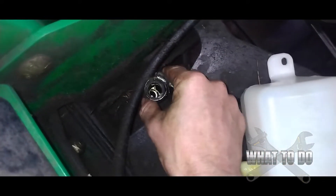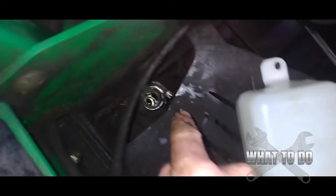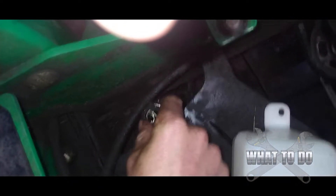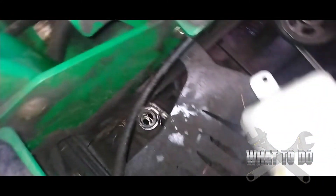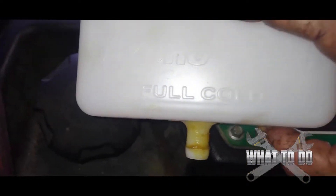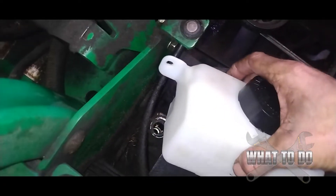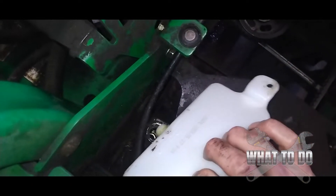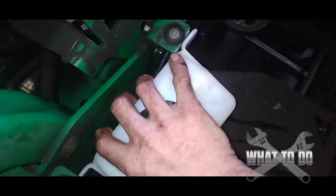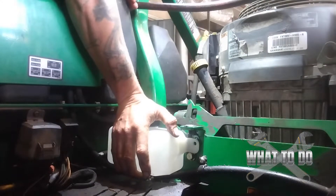Now we have our new reservoir. One thing I was worried about was that this hose was going to be really flimsy and hard to push back on, but at least Bobcat did something right here — this hose is actually really tight. You will be able to put some pressure on that and slide it straight down. What I did was take a little bit of grease and put it on that bottom nipple just to help slide it down a little easier in case there was friction. So what we're going to do now is turn this, line that up with the hole, push it down in there — and there it goes, drops down in there fairly easy.